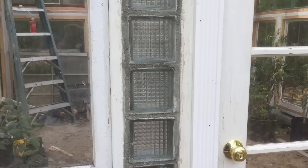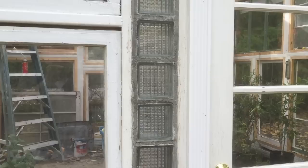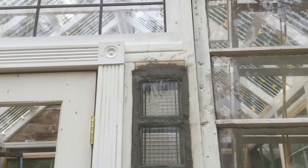I left about a six and a half inch space between the door frame and the window frames so I could fill in with five and a half inch square glass blocks. I basically mortared them in with regular mortar — not the thin set white mortar that others recommended, just regular mortar, and it's come together really well. Enjoy this video — it will give you ideas about installing your own repurposed or recycled windows in a greenhouse.